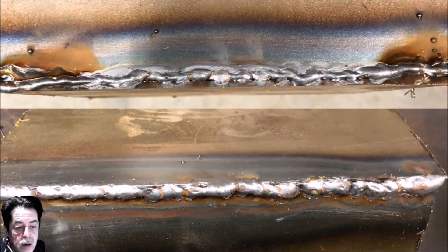A lot of this is technique and trial and error, but if you're practicing on scrap metal you'll figure out what works for you. As for how close you should be to the metal when MIG welding — fairly close. You don't want to be far away or the shielding gas won't do you any good. I use the Miller Matic with gas, not flux core. Stay close; otherwise you'll get spatter and all kinds of issues.